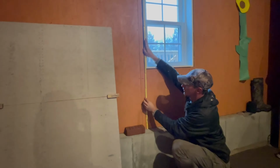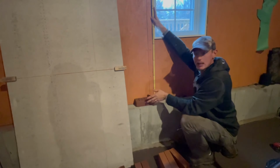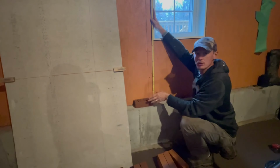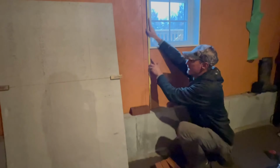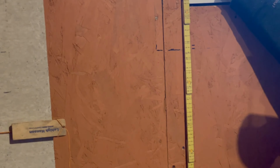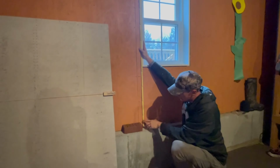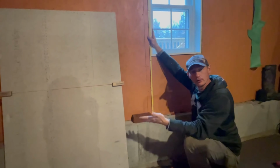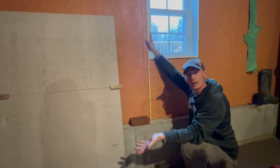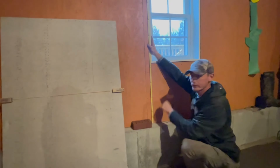And I know that these specific brick go really well on 4s. It's like a 3/8 of an inch joint or less, which is what you're mostly looking for with brickwork, if you can. But look, I'm high on there. So really, I'm probably like 3/16 of an inch high. But because I know the difference between each one of these is a 1/16 of an inch, I can say in my head, okay, well, I need to lose 3/16 of an inch. If I go on 3s for 3 courses, I'm going to be perfect height on 4s.